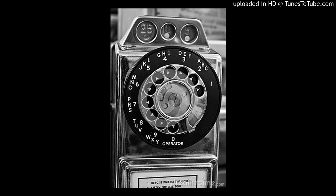Just to show you how phone freaks are always thinking the same, here's what happened next. I did put in a coin and tried 958, only to get a reorder. Why was it busy? Dave was using it. So I jokingly yell at him to get off 958, and then I finally do get through. The Newtown office happens to have cable test tone on some of its return supplies, so when the 130 volts comes, so does that tone. It's the only office I think that has that — it's a mistake.